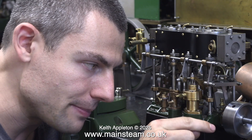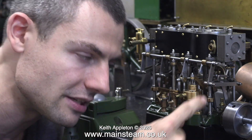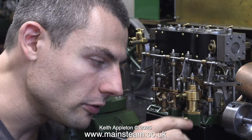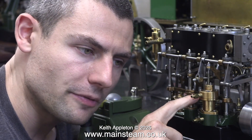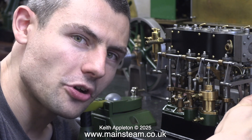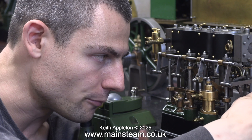On the bottom of the condenser there will be a pipe leaving and then immediately a check valve — we call this the foot valve. This is the first step of protection to stop things from destroying the vacuum of the condenser by coming in the other way. After the foot valve we go directly to the bottom of this pump. Anything in the condenser will fall through the foot valve — a one-way valve — into the bottom of the Edwards pump. With the piston at the top of the bore, any water from the condenser will come down and fill the pump by gravity through the foot valve. When the piston comes down, because it's also a check valve, it will travel through the charge of water to the bottom.